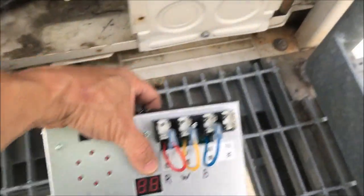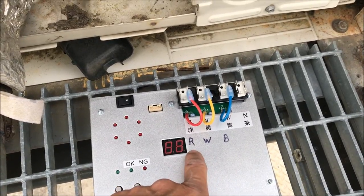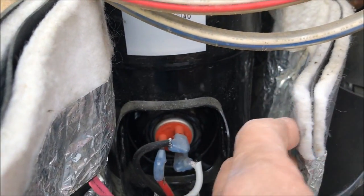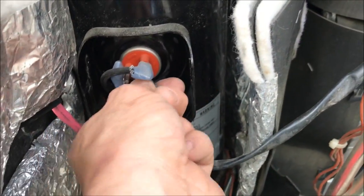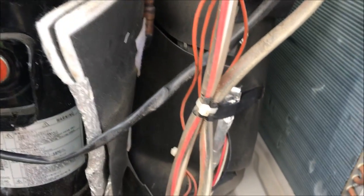So now I've got my inverter board checker, and I went ahead and put my little cheat colors on here off the compressors: red, white, and black. U, V, and W. When you take the sound jackets off, the sound blades, open them up, this unit hasn't been running for 2 days because it's been in error. But the compressors are warm, so that tells me my crankcase heaters are working too. Some little things you just pay attention to, you know, when you're messing around with this stuff.